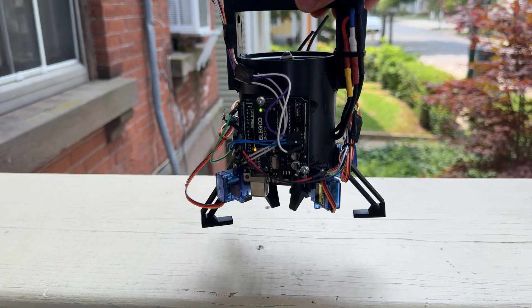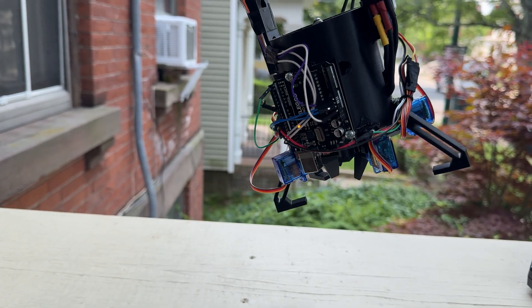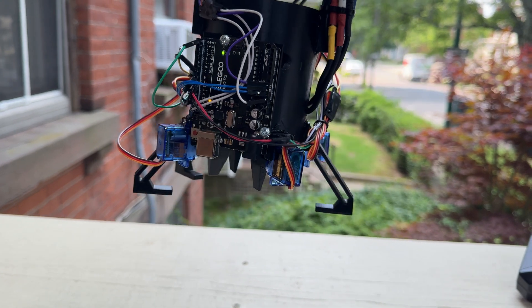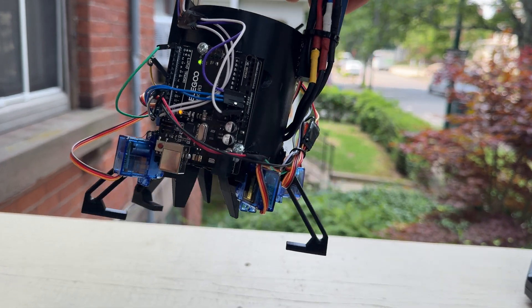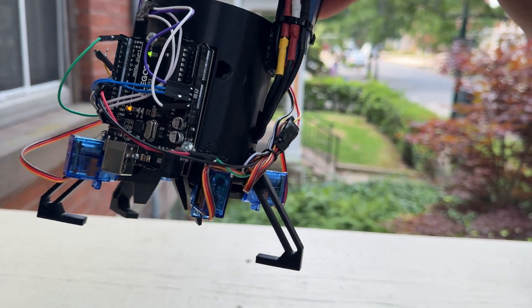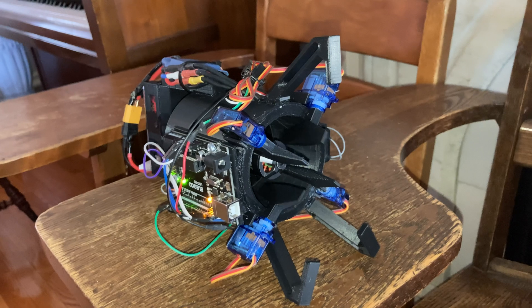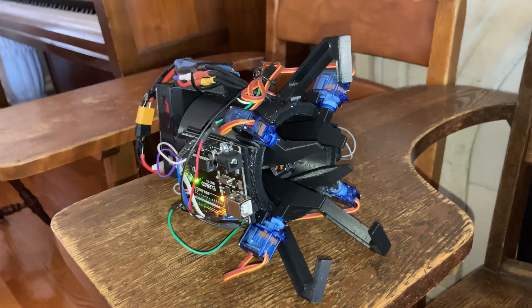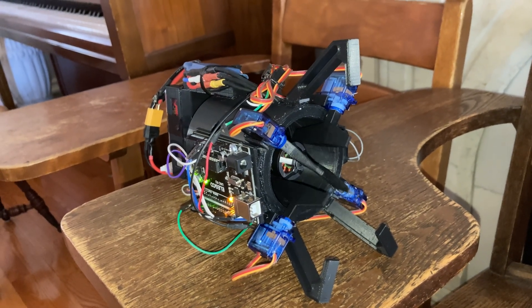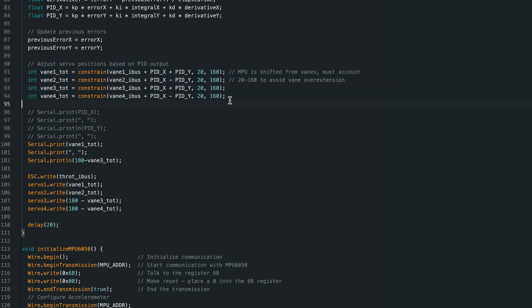I first coded this controller without a PID. My main goal was getting good angles from the MPU, combining them with the manual TX output if necessary, and going from there. I was successfully able to read the iBus inputs from the TX, use a complementary filter to get good body angles from the MPU, and loosely combine these to map values to each servo. Mapping the manual input took a bit of time, but it's actually pretty simple using the iBus library — calculating the difference between angles and the zero axis defined on startup, then mapping the error to the servos until the zero axis is reached again.